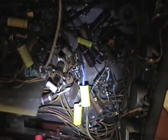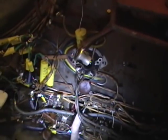What struck me as odd is I don't see a single replaced resistor. I can always find some bad resistors if I start checking. I especially don't like these sand resistors — these are an early form of power resistor and they generally start disintegrating, drift off value, or just burn out.